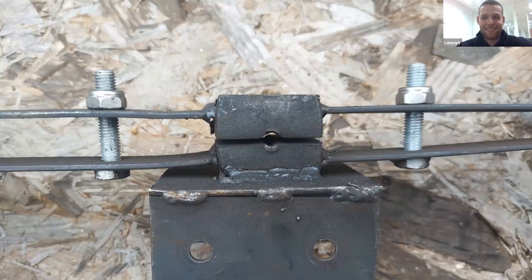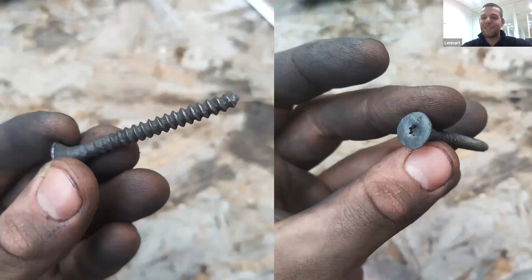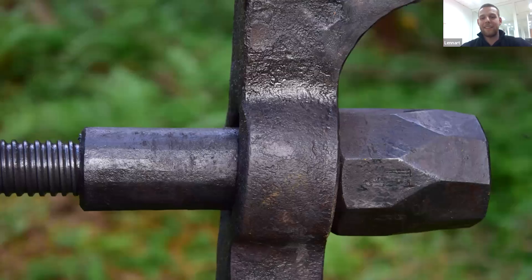The screw part is actually the easy part. I also had a little interaction with a blacksmith I met at a museum here who talked about making forged wood screws, so I had a little excursion on that. I made a tiny die which makes M6 or six-millimeter wood screws - they actually work; we tested them and they hold pretty well. But let's get to the harder part, which is the internal thread or nut.